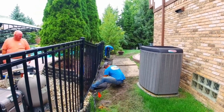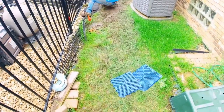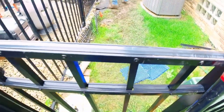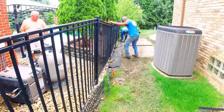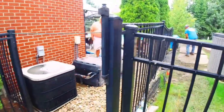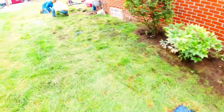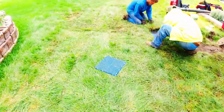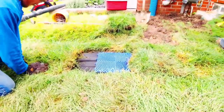Welcome to the French Drain Man Channel. I'm Robert Sherwood, and I want to explain to you how blind inlets in our systems work. We do a burrito-wrapped system, and we have a special fabric that we have double-punched for a high flow rate. It works its best once the sod and the roots have actually grown into the holes in the fabric so that the water can run through the sod and down the root. Both capillary action and gravity create an incredible pathway for the water to drain from the surface of your yard with a burrito-wrapped system.